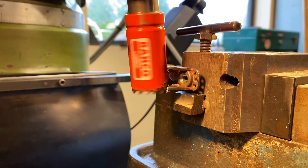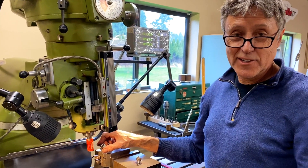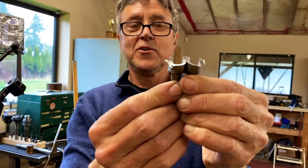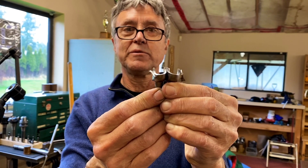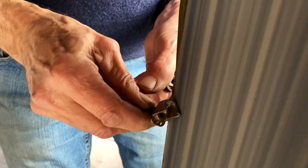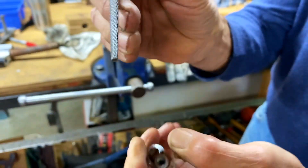Also notice that you don't have any safety glasses on — whatever happened to safety third? Speaking of safety third — what's first and second? Looking good, going fast, safety third. So there are your bosses — they've been mitered. You can see how they're at an angle of 7 degrees. Now we need to take off the burr. I have a few little burrs on the inside, so I'll take this little round file.